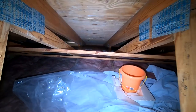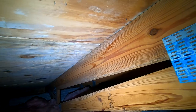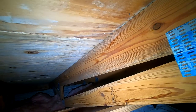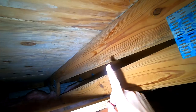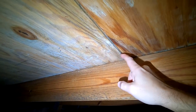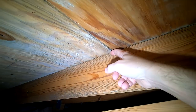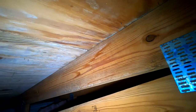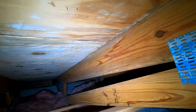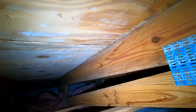There is probably a small tear in the tar paper on the roof, or maybe a little nail that started sticking out, and this causes the roof to leak. The most pronounced leaks are in between gaps where the plywood meets — there is a small gap, and this is usually where I see the leaks. So I'm gonna measure what corresponds on top of the roof and go fix it.